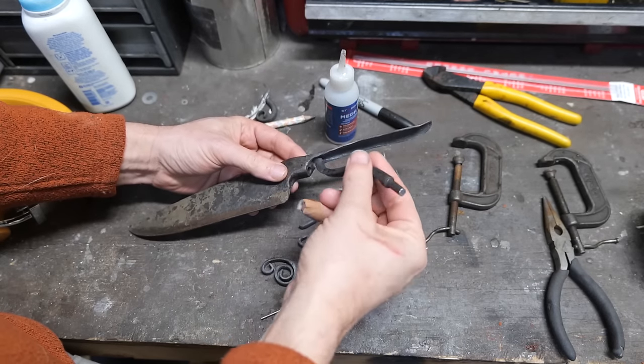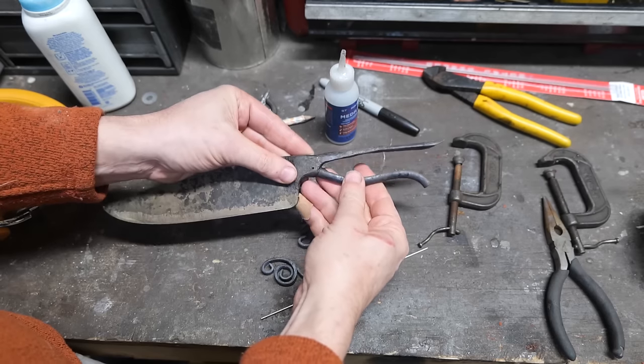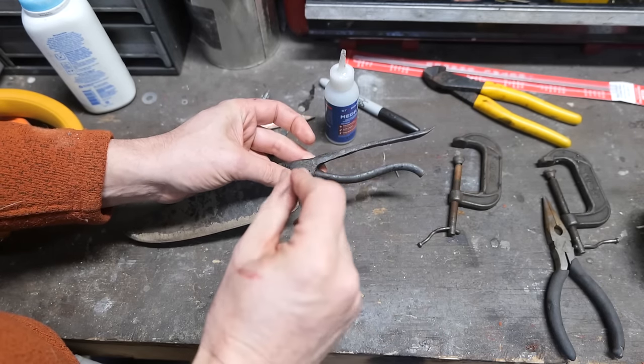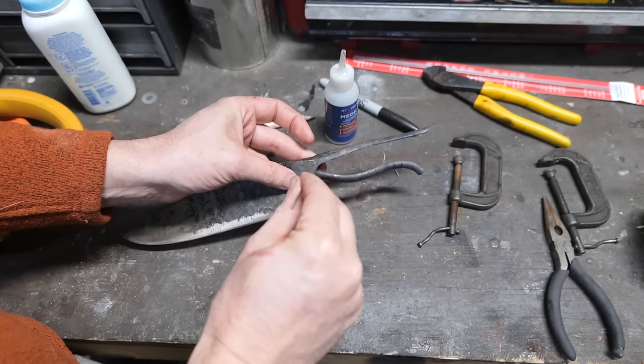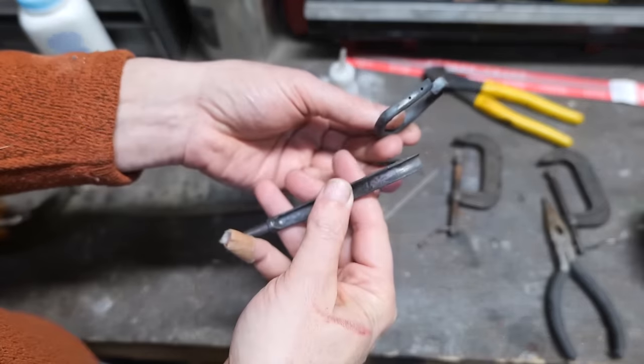The plan is to eventually solder and pin the belly piece in our hole in the bolster area here. We'll have to clean up the scale on the inside of the hole and our piece for the solder to do anything, but even if the solder just keeps the empty space full, then the pin will be enough to keep things in place.